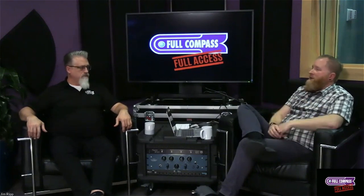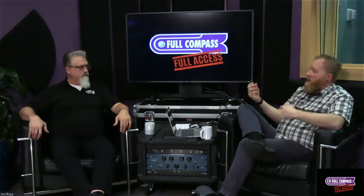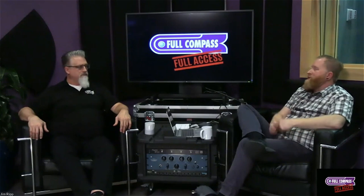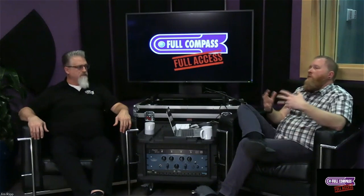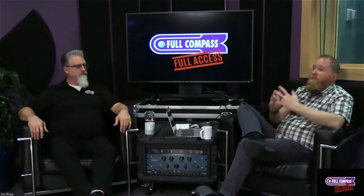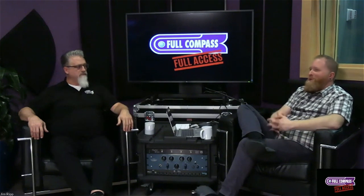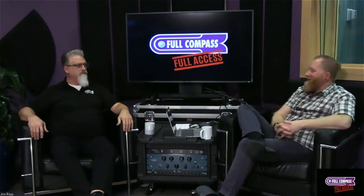That was designed as a traditional wireless system for conferencing spaces, a 2-channel system, but it also has Dante input, so you can do like a 901, let's say, in the room that's picking up the boardroom, but maybe I still want a presenter on a traditional system. So typically when you want to mix and match, that's when you're going to use those DSPs, so you've got the ability to do echo cancellation and processing of things that might not necessarily have it on the microphone like the MXAs do. So it is very flexible, and that's another joy of doing Dante. You can bring a lot of different things together.